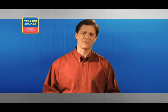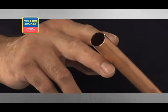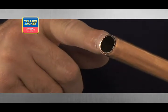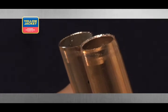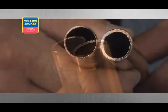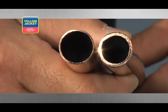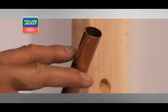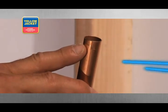Let's take a look at what over-tightening the tool's grip really does to the tube. Here is a perfect cut, and here's a cut from a tool that has been over-tightened. Notice the thickness of the tube's wall at the point of the cut. This cut has rounded off the end of the tube, and the wall thickness has been compromised and may crack when you flare or swage that end. In contrast, the tube with the perfect cut has its entire wall thickness intact at the cut end.